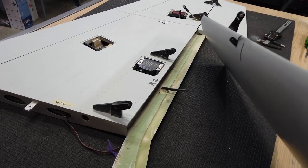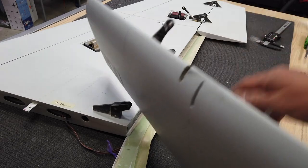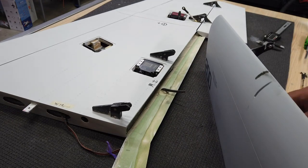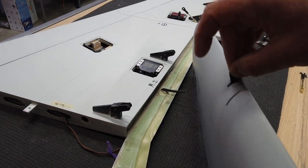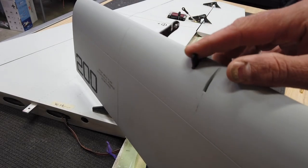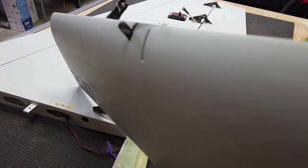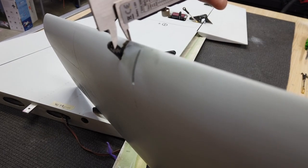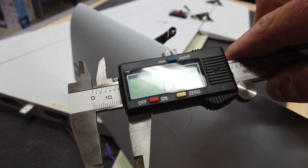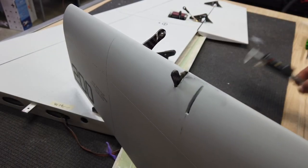So I've gotten the slot opened up — I just used my Dremel bit as mentioned and got that all opened up. This carbon piece I've got jammed all the way towards the top. With that in that position, we are so flat to center, sitting at 15.3 millimeters — call it 15 millimeters. That's going to work way better than what we had previously.